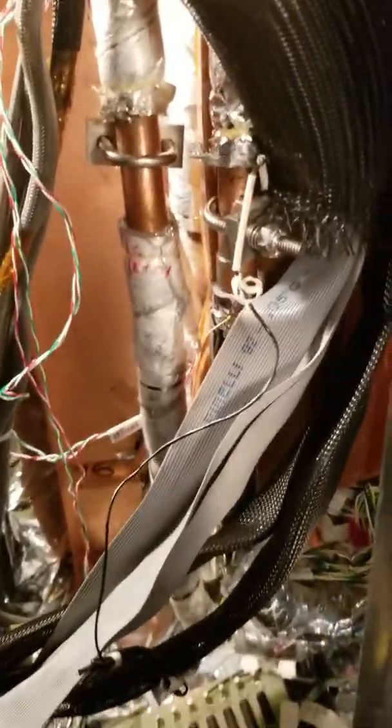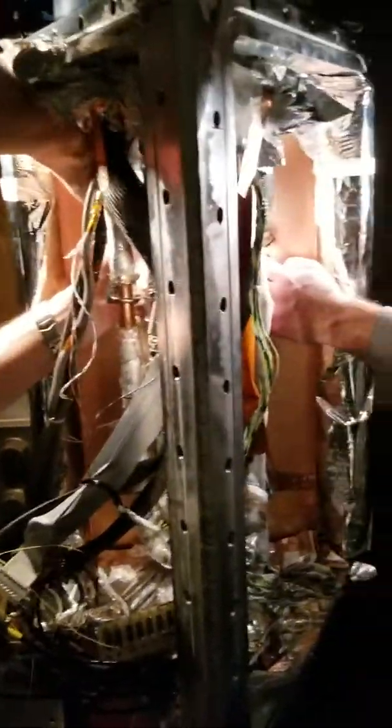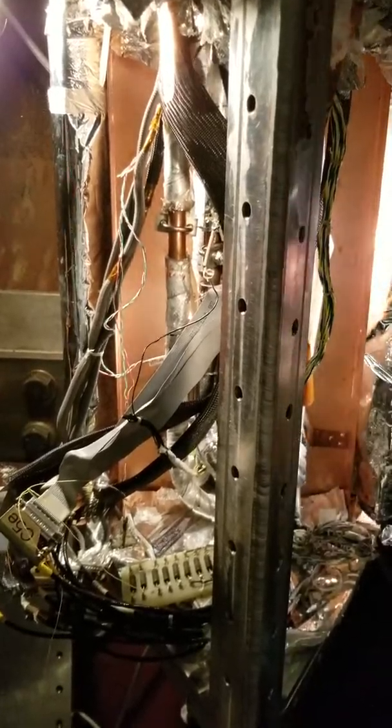The flange is disconnected - this can lift right off. There's a copper gasket in there, you see that? What I did was I made these straight-through with silver-coated screws, so they're anti-galling. It's a fully rotating flange on both sides because you need that to catch them all and tighten it. I was able to use a regular Allen wrench in there - that's good.